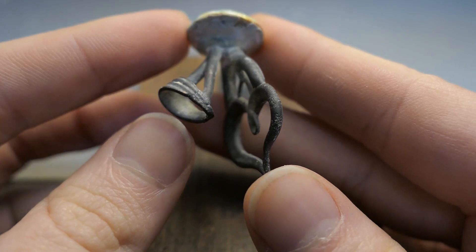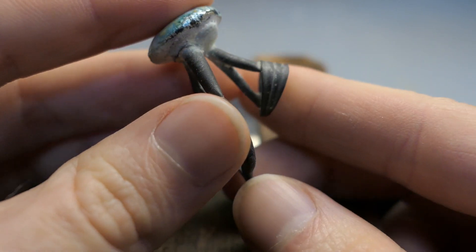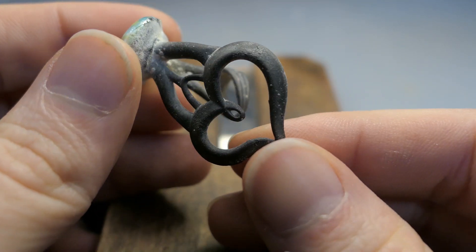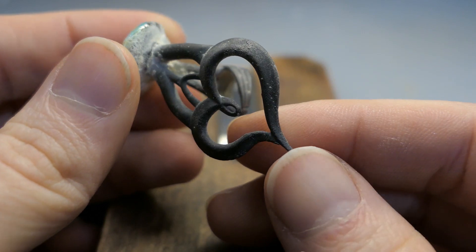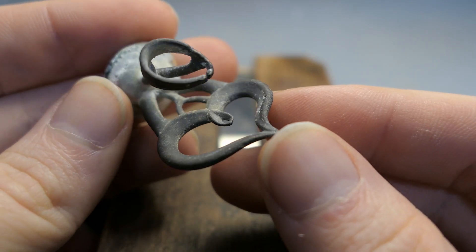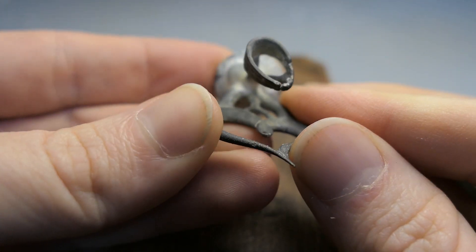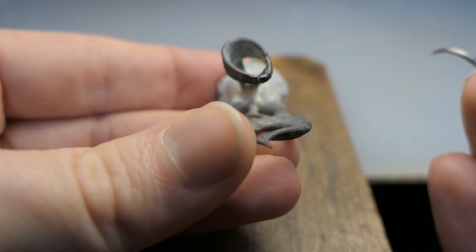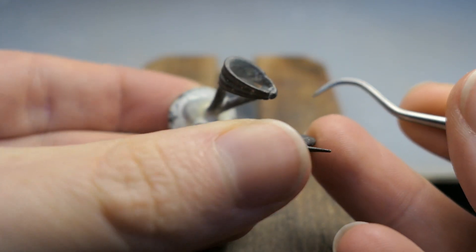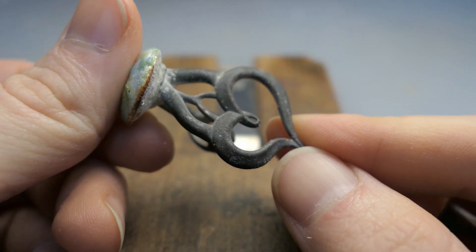Most of it came out pretty clean, but there are a few spots that look a little rough. There are a lot of things that could cause this — it could be from leftover ash residue that wasn't fully evacuated from the mold, or from many other problems like the temperature of the flask rising too fast during burnout. You can also see that the thin end of the bail has some imperfections, and it looks like the silver was starting to solidify before it was fully able to fill that area. For me at least, each new casting comes with some trial and error to figure out the correct casting method.